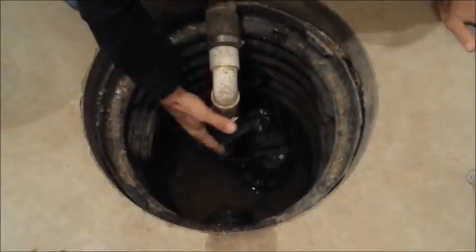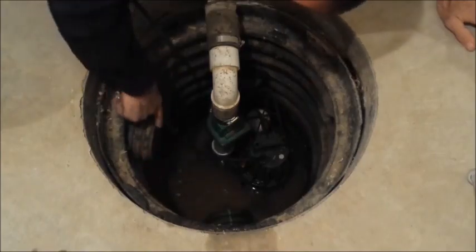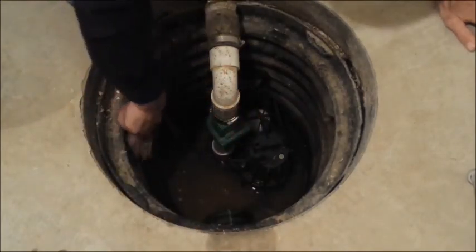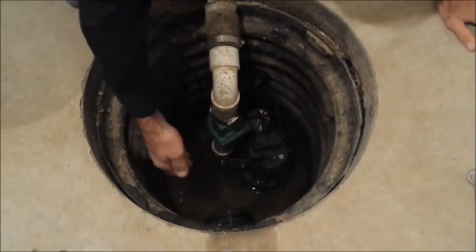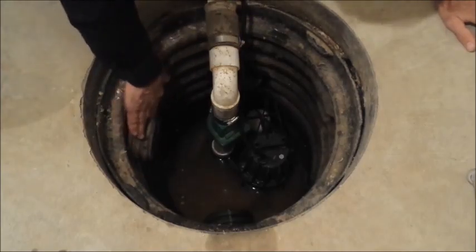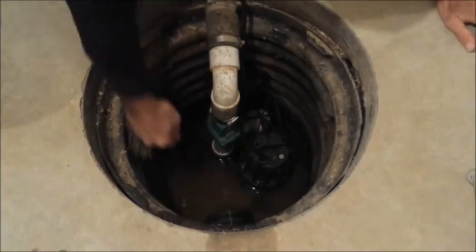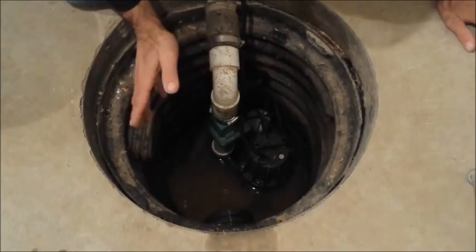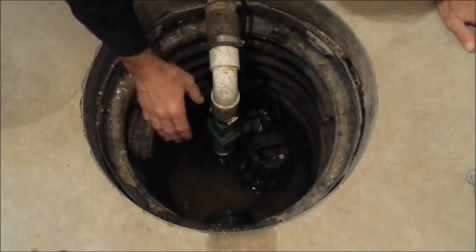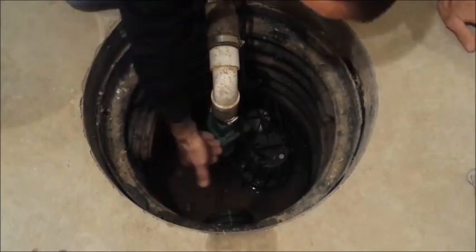We're down in the sump pit here. This is called the sump basin — just this bucket-type thing down in here. This particular design has tubes or pipes that run around the perimeter of the basement, drilled right through the side of the sump basin. When rainwater collects underneath the floor or footing of the house, it migrates through the gravel bed under the floor and into these pipes that have holes in them, then the water runs out and dumps into the sump basin. Another way you might see this done is with small perforated holes drilled all around the side of the sump basin, with gravel surrounding it, so water collects in that gravel and runs through the perforated areas to fill the basin.